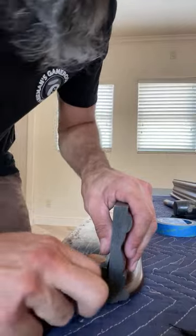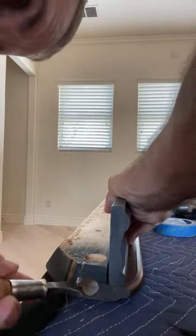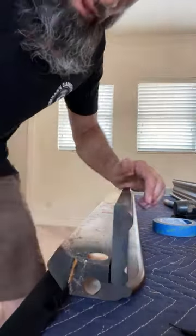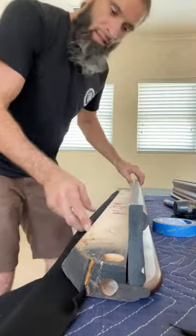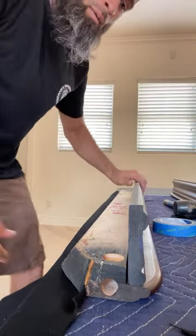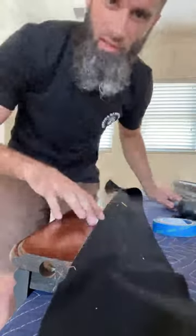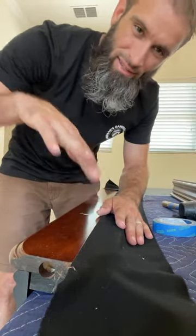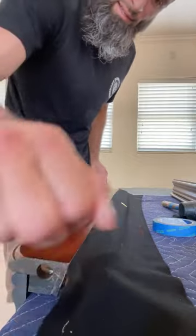There's a guy at the billiard factory in Austin. Couldn't tell you his name, probably because he didn't last long, but he would work on this workbench, and the whole workbench would be going like that as he was pounding the cloth. It just didn't make any sense because he didn't have any resistance to help the feather strip go down. And of course, he put 100,000 staples, and when he pounded the feather strip up here, he was smacking it so hard that the feather strip recessed down in there, and you were able to fill a gap between the cloth, so it was kind of a dip. So we don't want that dip, especially if you're delivering $5,000, $6,000 tables brand new.